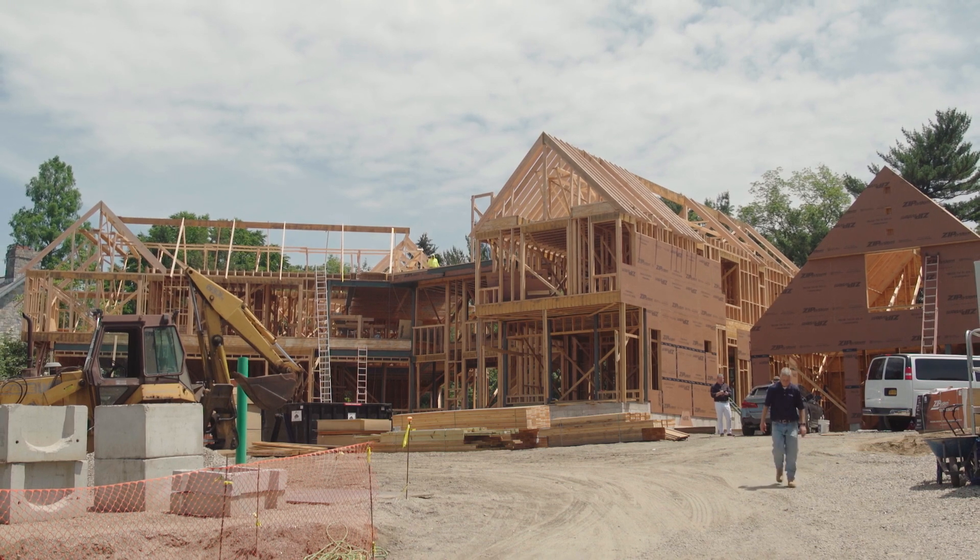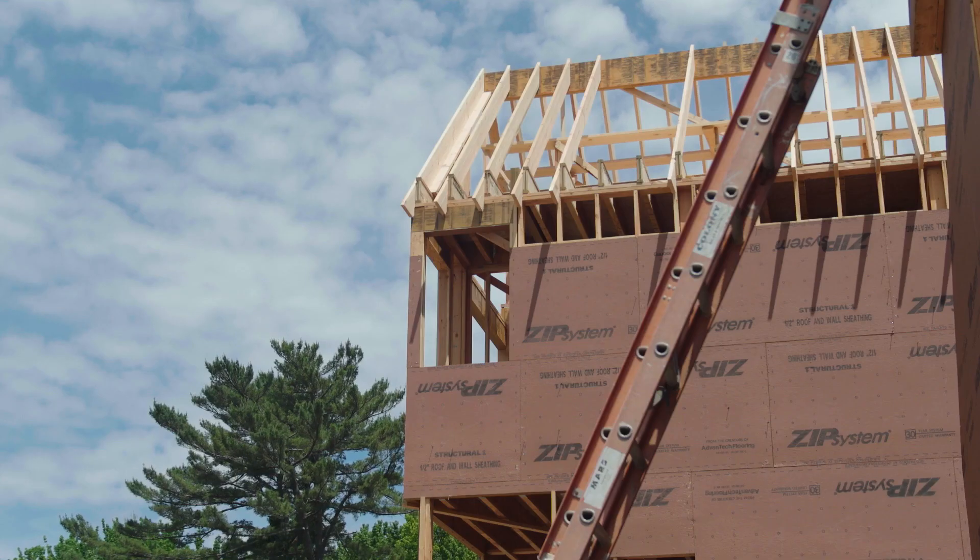It's a 12 perm, meaning that it's vapor permeable. It's not going to trap moisture within that roof system itself, and it can be left to the weather for 180 days to make sure that while you're working on the project before you get your roof shingles up, you're still going to stay nice and dry while you're working on the interior of that house.